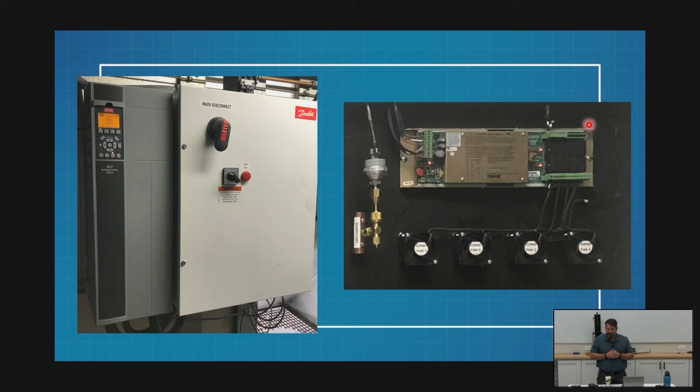What am I going to do, Carrie? Sorry. Wait, say that again. I was putting that. If all of my fans are on because I've lost control and it's too cold outside, what am I going to do? Yeah, the discharge pressure is going to drop. Start unplugging fans. Pull fuses out, right? Shut down fans. Shut them down the same way the computer would. Farthest from the header towards the header until I've got a proper pressure.